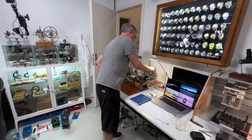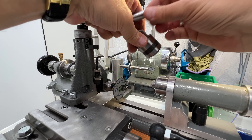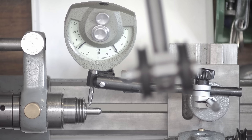I had planned putting camera mounts on it — there's a camera mount on the side there, and eventually I put cameras above it and in front of it. One of the first things I did was cut the back off of an M1 taper. Now, if you buy a cheap lathe but it's got high tolerance, that's one of the main things that matters. Expensive lathes can have more accessories and higher tolerance, but this lathe — this workpiece in this lathe with this collet — is within one one-thousandth of a millimeter. That micrometer is measuring one one-thousandth of a millimeter, and it varies less than that in a 360-degree rotation. That may be the workpiece itself or error in the micrometer, but in any case it's a very accurate relationship between the lathe and the collet.